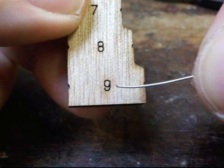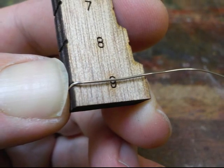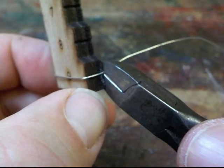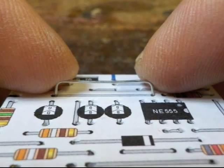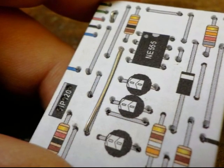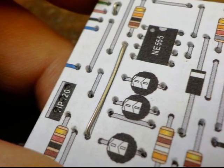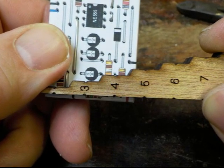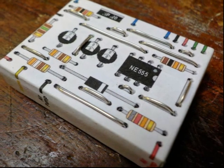This one needs to be nine holes wide. As before, line up one end of the wire with the base of the jig and hold it in place, then bend the wire over the jig, finally cutting it off level with the base. Line it up on the circuit layout and push it down. Try and keep the wire links straight — if they bend around too much they might touch another component, cause a short circuit and prevent the NempNet Throbwell from working properly. Now carry on and measure, bend, cut and fit the rest of the wire links to your circuit.